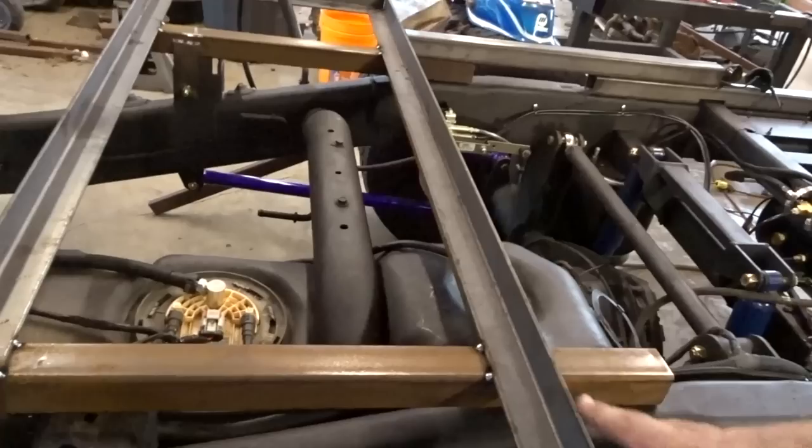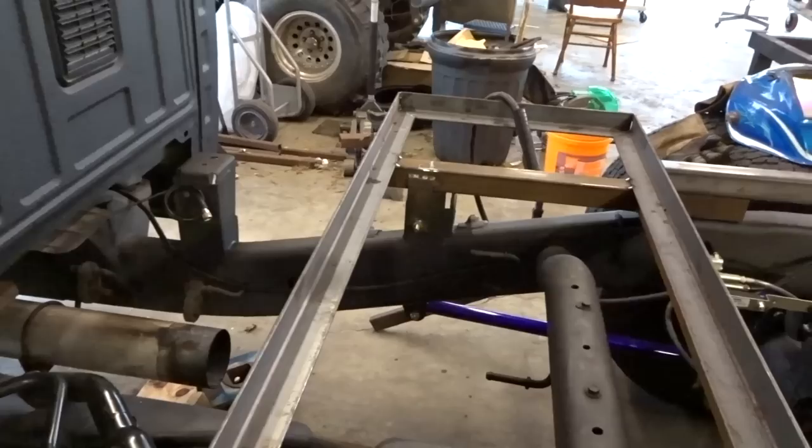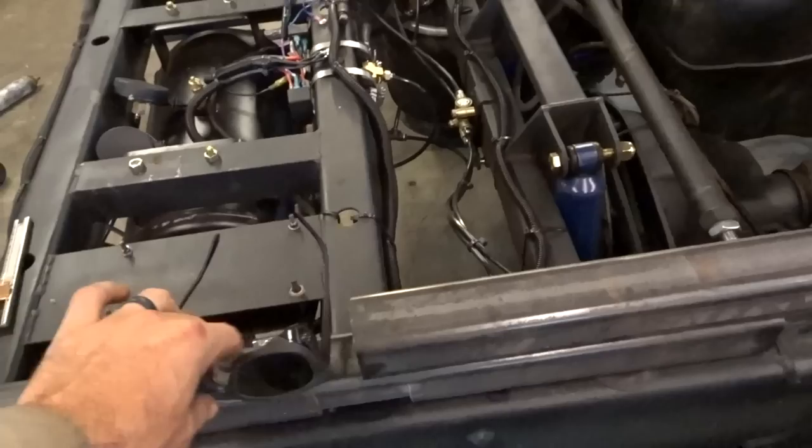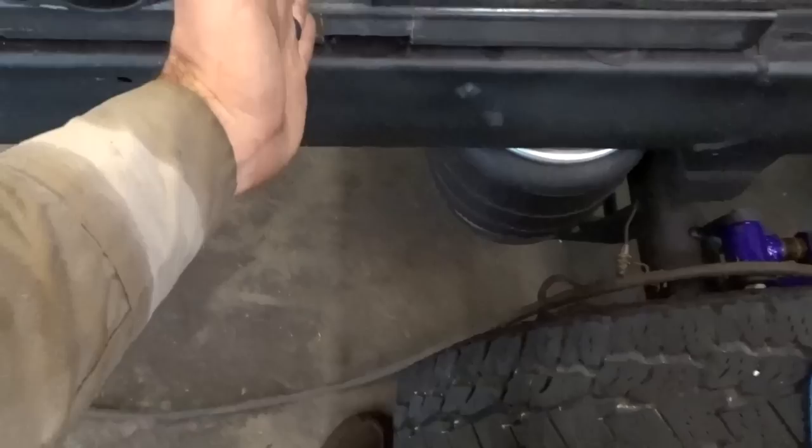But this here is fit for Lincoln only. Lincoln, that's what my SAE 300 is. This is the footprint of it, basically, or any 200 for that matter, old SAE 200. But here, I'm going to bridge the gap just like this right here with these two. And then right here, I'll put a cross that'll run this way. It'll come out here. That way we're going to clear the wheels right here. Come out not very far. That way we can just drop straight down with a plate.